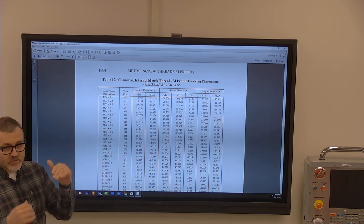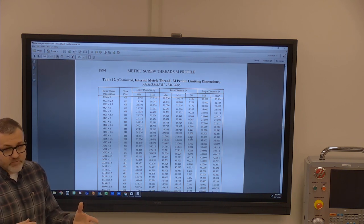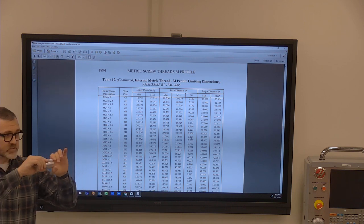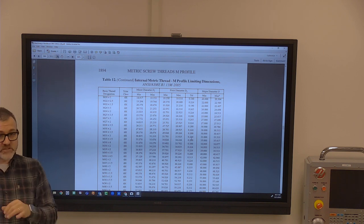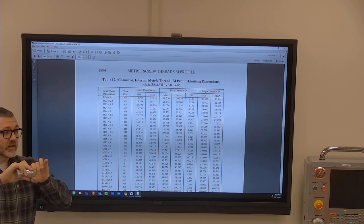So you know by the letter and the number, then looking at a chart, how much tolerance you get for that. Even on metric, a lot of the metric tolerances, if this is 2 inches and this is a hole that this is going to go into, it wouldn't be 2 inches. Let's say this is 50 millimeters. It'll say this is 50 millimeters. But 50 millimeters doesn't work, right?